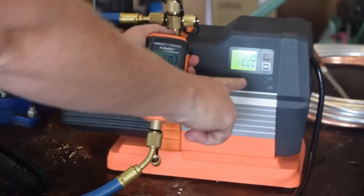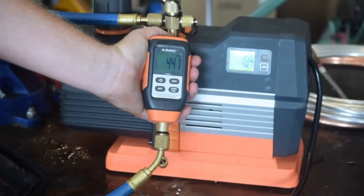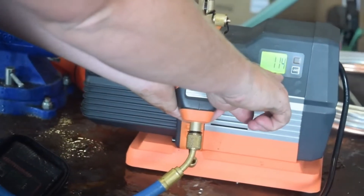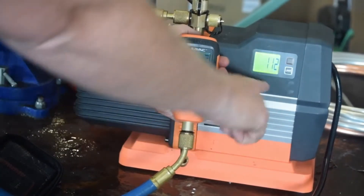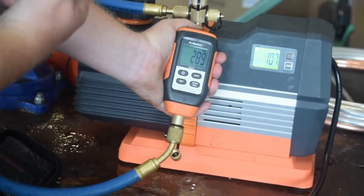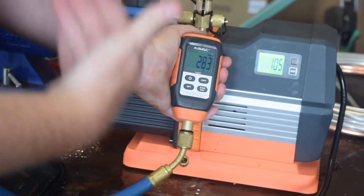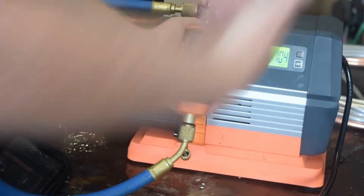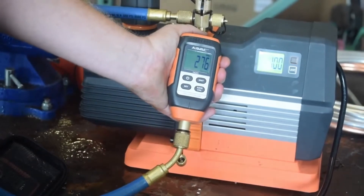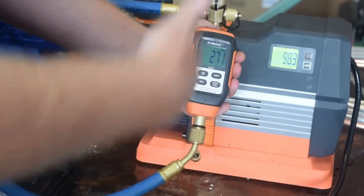You can already see we now have a much larger difference between the two gauges than what we had previously. Not only is it not coming down as quickly, but there is a greater differential — a greater pressure drop across the rig. And we don't have any Schraders in place; this is a high-rated vacuum hose. If you were to do this through gauges or through Schraders, you would have a much higher differential between what you're seeing at the pump and what you're seeing at the system.